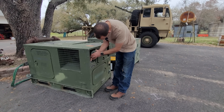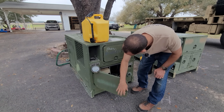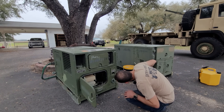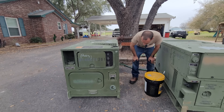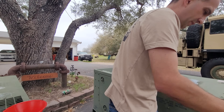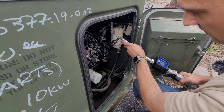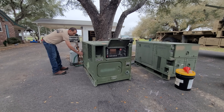I don't see anything leaking, not obviously. The next thing is to put some coolant in — it says it takes 6.1 quarts. It's definitely not full, but that's what it's getting. Then I've got to fill the oil — it says 5 quarts from empty. Just putting Rotella T4 15W40 in there. Fluids have been put in, slave cable is hooked back up, now I'm going to turn the breaker on and see what happens.